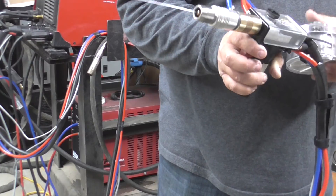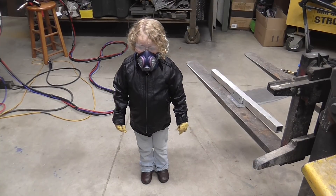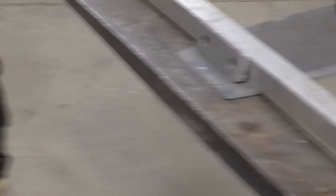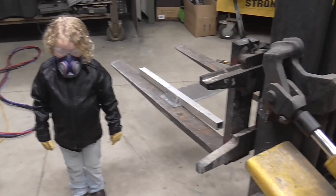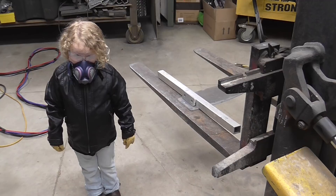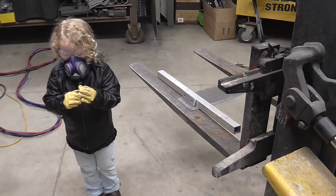That's very good. So today we're going to do some aluminum here. We have the full protection gear including a respirator for aluminum. That's our joint right there — a T-joint. We'll be using a spool gun with 3/64, 0.047, 1.2 millimeter wire, 4043. It'll be a pulse process, and this is a water-cooled spool gun with full synergic adjustability.